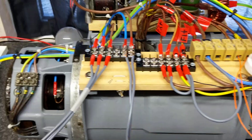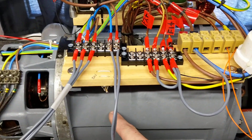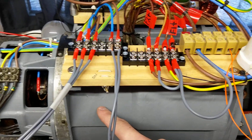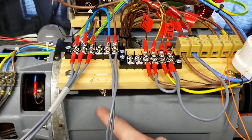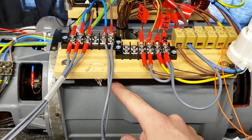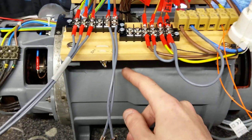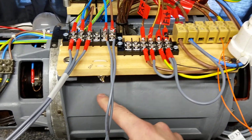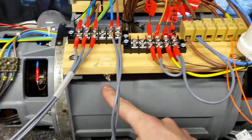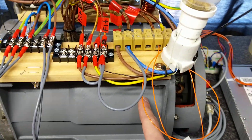The single-phase is generated in a bit of an odd fashion — it doesn't have a rotating coil of any description. It just has laminations in a weird triangular fashion, so it kind of drags the magnetic field around. The field winding and the output winding are both wound on the stationary part of the stator.